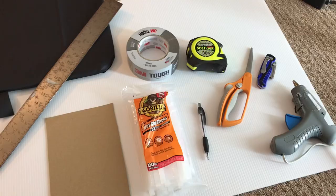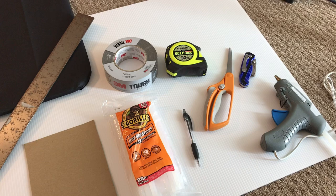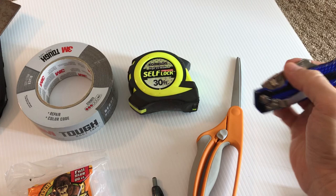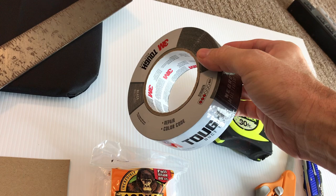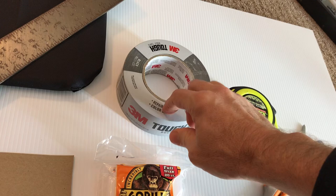These are really quite easy to make, though they do take some time. The more time and patience you take, the better they're going to turn out — to the point that they'll be airtight, and when you push them into the window you'll hear the air rushing out and make suction. What you'll need: a pair of scissors, a sharp razor blade knife, and a tape measure. For tape, we're going to use 3M duct tape — I use black and white. I don't like the Duct brand and definitely not the Walmart brand. I got this at Lowe's and after it sits for a while it really bonds up. It'll also serve as an intermediary material when we do some gluing.